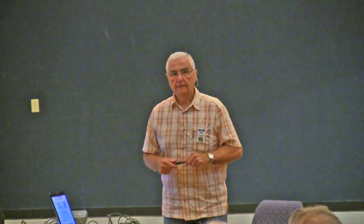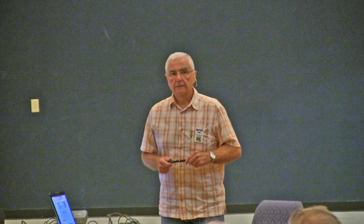As you get near the resonant frequency of the two transformers, does your antenna become very efficient or very inefficient? No, there really is no resonant frequency. If you take an MFJ analyzer and connect it to one end and sweep it, it's a constant. The SWR is basically constant from below the broadcast band up to 20, 30 megs. It's not really resonant.